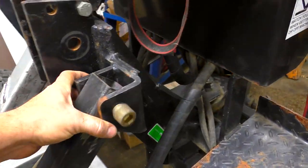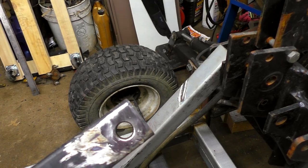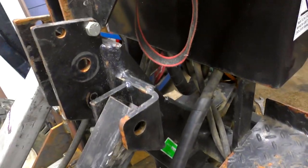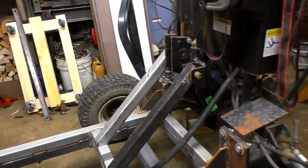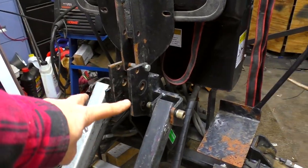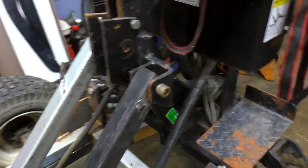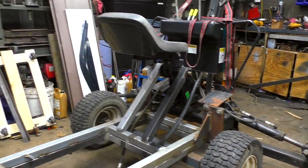I just cut and bent over the tube so they fit nice on there. I didn't do as good of a job on that one but they're not tacked in or anything. There's a bushing down in there — it's 5/8" inside diameter and I believe 1" on the outside. I went ahead and drove 1" holes into the tubing, welded them in flush, ground them back down, then you just get a bolt in there. This allows me to convert the three-point hitch backhoe back into a three-point hitch — I'll just take out these two top bolts and the five bolts on either plate, detach it right from the framework, and the hoses have quick disconnects so I just pop those out. It can then be used as either three-point hitch or tow-behind.